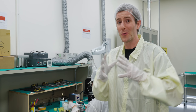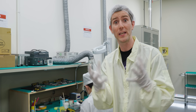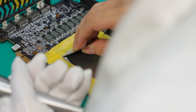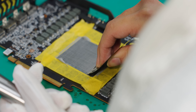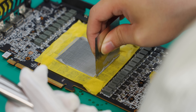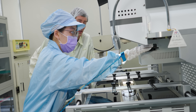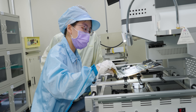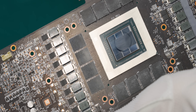We asked them to show off the full capabilities of their latest-generation BGA rework station. Solder paste is applied to the board using a mask, then the GPU and prepared board get loaded back into the rework station, heated, aligned, and reapplied. This is not the kind of thing you'd want to do very often, but for diagnostic purposes it is sometimes necessary.